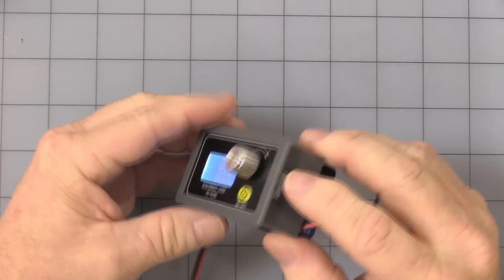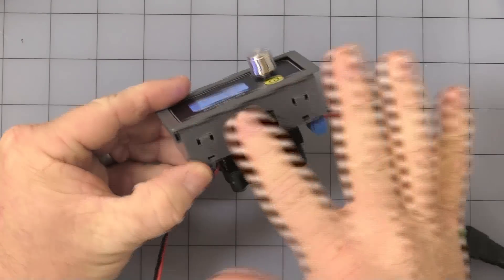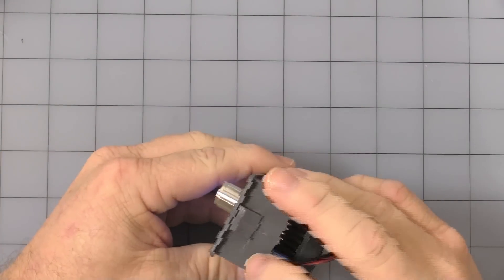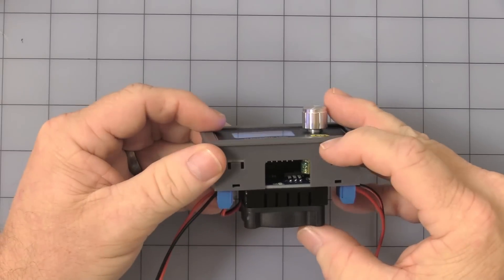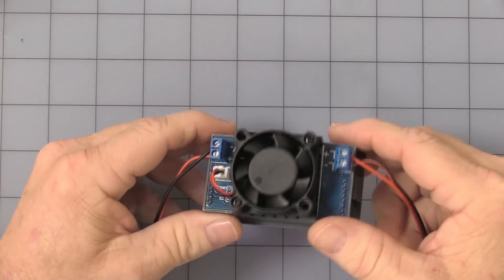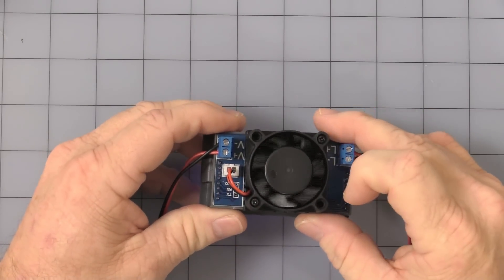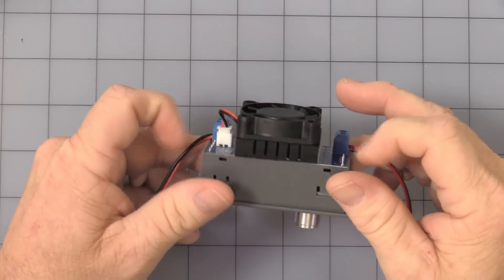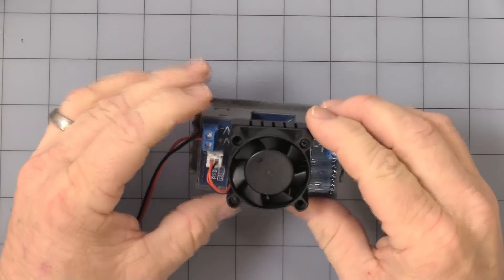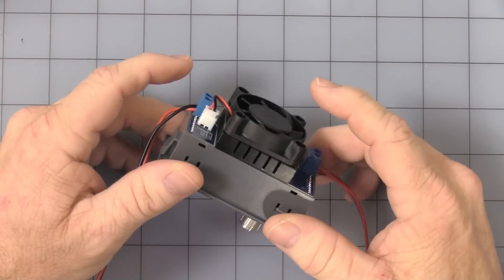It's designed to fit in a cutout, snap into a panel — 76.5 millimeter by 39 millimeter — and it's about 44 millimeters behind the panel. But you must make sure you keep plenty of space for this fan and this heat sink to cool the unit, because it does get hot. Simply snapping it into a small box with no ventilation, it will quickly overheat.